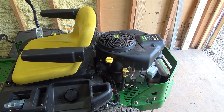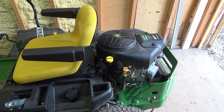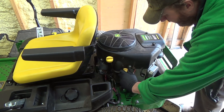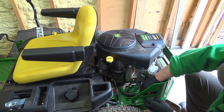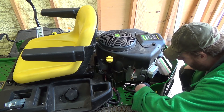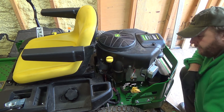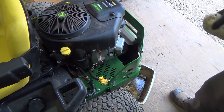She's good and warm. I took her for a ride around, fired up the mower deck, seemed to be all good. Checked the blades — I'm not going to sharpen them right now, they're not too bad yet, so I'll cut for a bit in the spring with those blades on. We've got to get our drain pan, and this is a tool-less thing, which is nice if you remember from last year. Pull this guy off and then the little tube — I kinda wish it was longer. I usually went out the back with it, and I think I had something to weigh it down, like a rock, because I've got lots of rocks around my backyard for this general purpose.